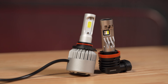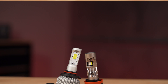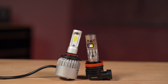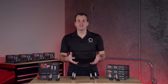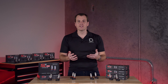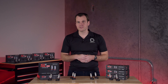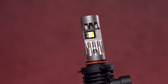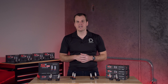As we try to make the emitting point smaller to get better performance, that space shrinks, and now we've got to get heat through to the circuit board in a much smaller space. That presents some serious challenges. One other factor that makes this really challenging is that with LED bulbs, they're two-sided, and that's because LEDs are directional. Unlike a filament that shines light in all directions, LEDs shine only about 180 degrees, meaning we have to put them on opposing sides of the same circuit board. When you have heat on both sides, that doubles the problem of getting that heat out.